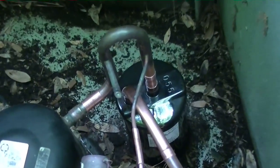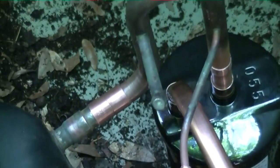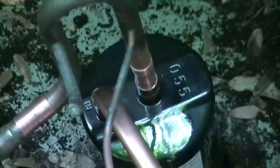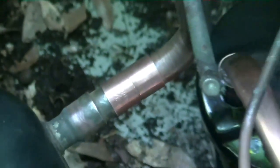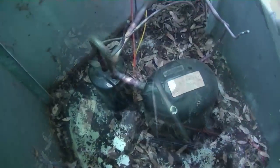Alright guys, we have our joints put together — a sleeve on the charging tube there, swaged into there. We're using most of that original piping on the other piece since it had the charging port tube coming into it. Had to cut a small piece to get it off the accumulator. I'm going to weld everything up while flowing nitrogen, and then we can put it under a pressure test.